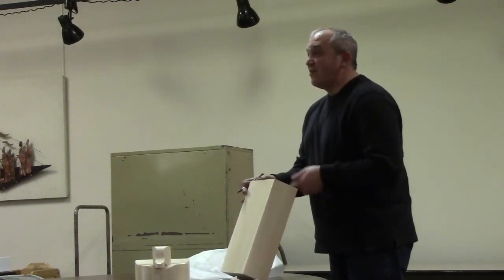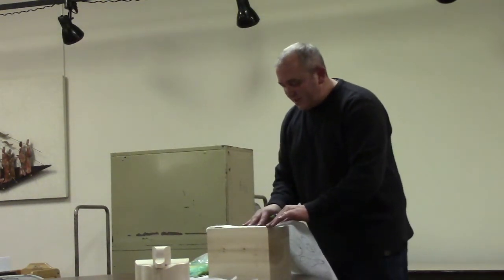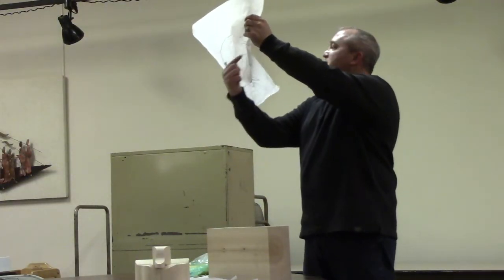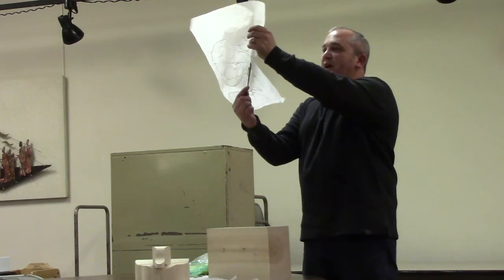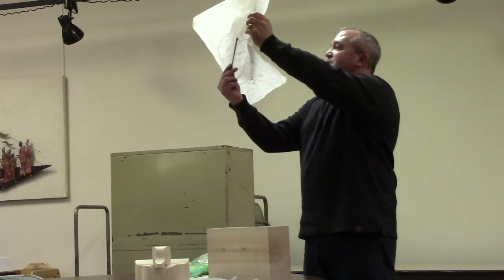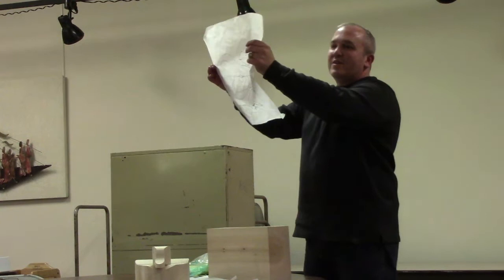So when you draw your side pattern on, you want to make sure you start at the front. If you go backwards, you just wasted your block of wood. So I'm going to line those up. And when you're drawing your patterns too, you want to make sure the length of your side profile from front to back is the same length as your top profile. That's important as well. And then I kind of lay out the tail, like here's the back of the tail, front of the tail. So I draw that here to here, so they're the same length. And then these feather groups, the side pocket from there is the back to match this. The front is there to match this. So just keep that in mind when you're drawing and developing a pattern.